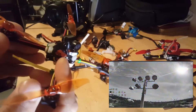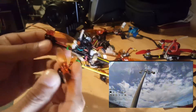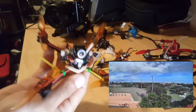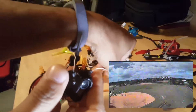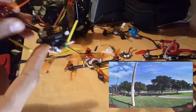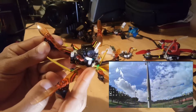The second thing I did on the pickle frame build was add an onboard DVR — the Diamond VTX. I removed the motor plugs and directly soldered the wires to the board, then lowered the board down, which gave me more space to fit the Diamond VTX in there. What I ended up with is a drone that weighs the exact same as when I had the canopy on it, using the original simple TPU mount that came with the frame. So I lost pretty much nothing by adding DVR.